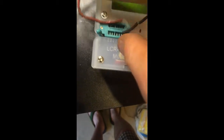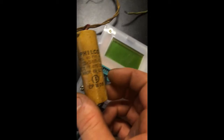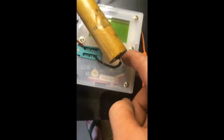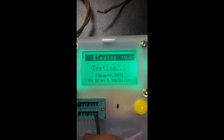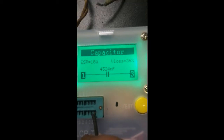Replace your capacitors — this one is junk, nowhere near where it should be. Besides, these things take up a lot of space. I've seen people try to repack them, but it seems like a waste of time. Last one: this is also the original 1947 Philco rated at 12 microfarads. It reads 4324 nanofarads, 36% loss, and 18 ohms ESR.